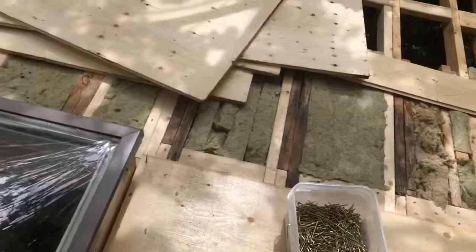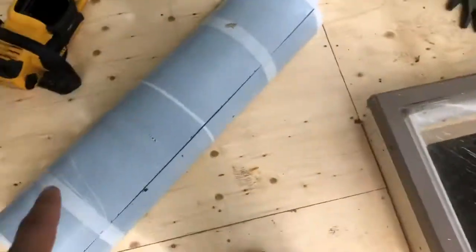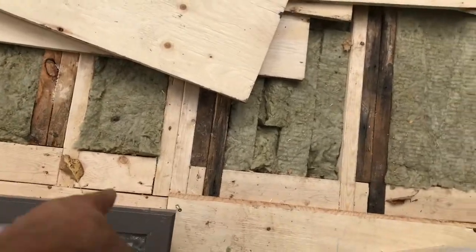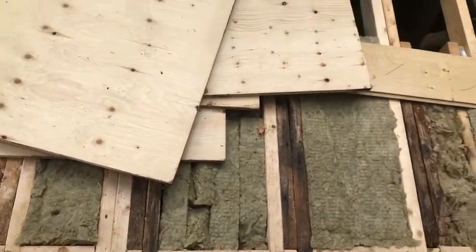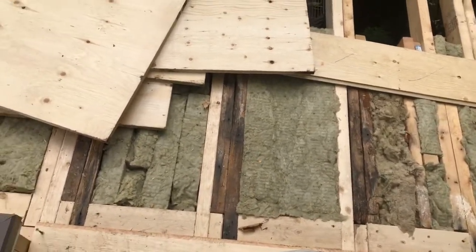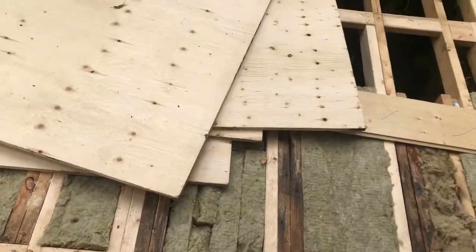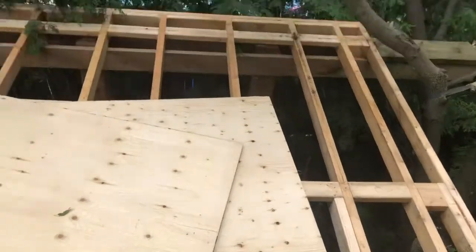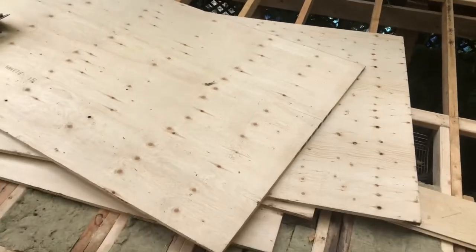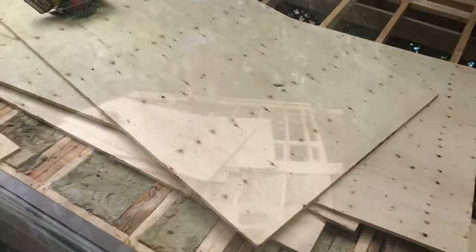Lunch break's over, we're back at it. I just changed ahead of a shower because when you're working from home you have that luxury. I'm out of breath because I had to lift this thing - it probably weighs about 100 pounds. That's the membrane. We're going to continue the tongue-and-groove across there and then start building back this way. I'm assuming the four sheets right here will be enough, with some cuts, and there'll be some piecing in for the top part. I'll flip the camera over and we'll go on time-lapse to push this ahead.